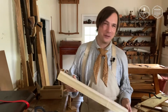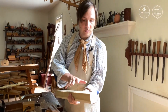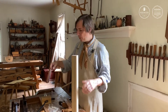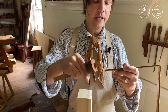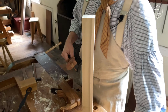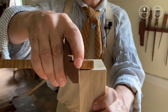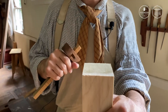Going down to the bottom, we squeeze the calipers in and it's right about one inch. So we have to reduce that leg down to half of its thickness at the bottom. Our basic stock is square — planed nice and flat — so all sides are perpendicular to one another. Now we're going to lay out that one-inch square on the bottom by superimposing it over the two-inch square. The marking gauge is set at a half inch; scribing it all the way around marks a parallel line a half inch from the outside. Taking off a half inch on each side leaves one inch in the middle.